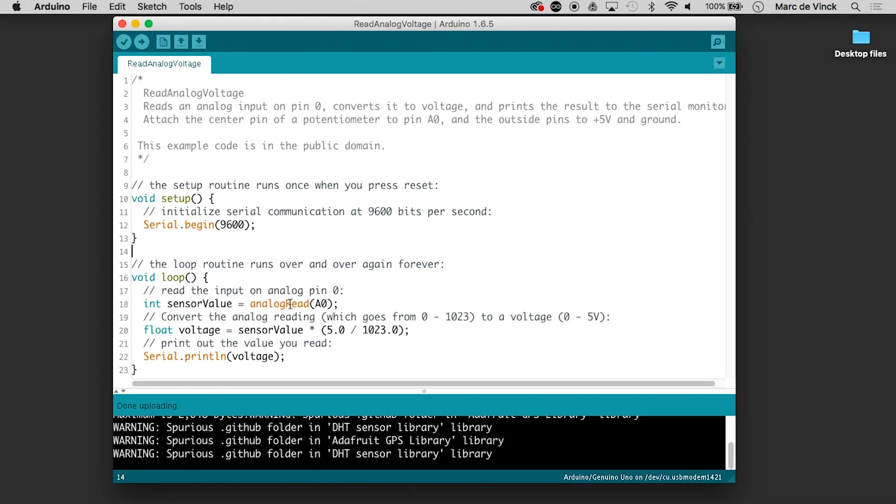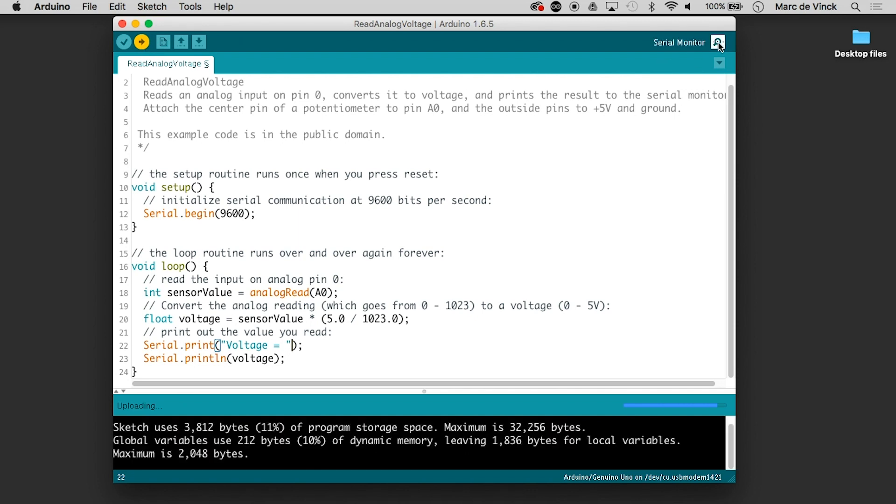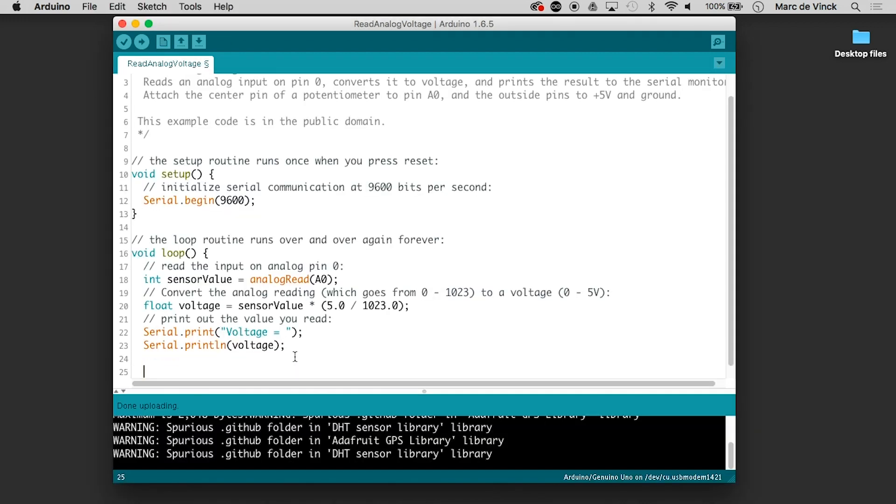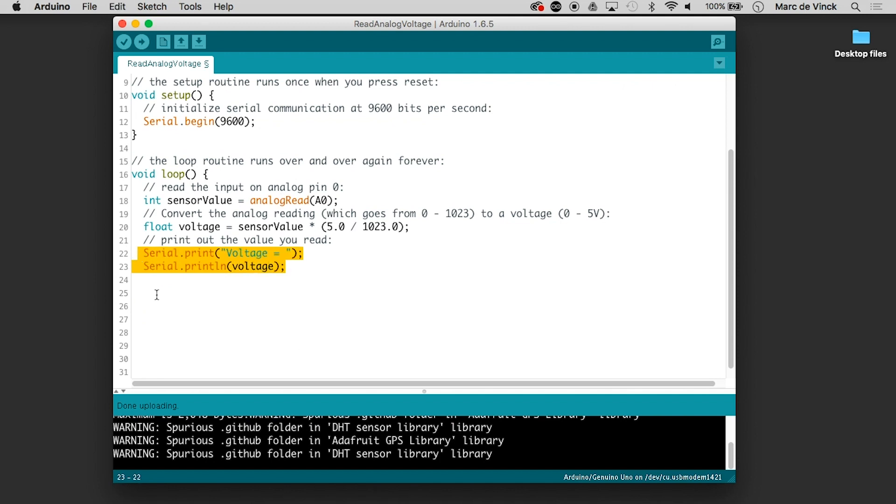Before I do that, let's modify the code a little bit. We'll close the serial monitor — printing the voltage is nice but let's make it a little more useful. I'll copy that line and do a serial print with the label "voltage =" in quotes. Now if we upload that we start getting a little bit nicer formatted data. Now let's convert that to UV index, so I'll copy this and paste it down, then add one more serial print with a space and vertical bar separator.